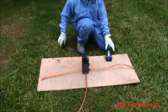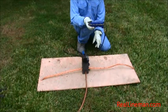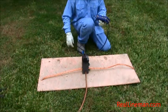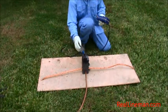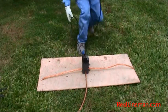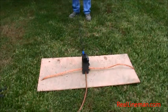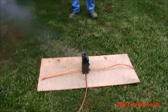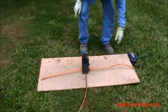When I get ready to shoot this off, I'll stand back the length of my cord, push the button to ignite it, and then jerk the cord off of the shot. The reason you jerk the cord off is that sparks fly out and will eventually melt through your cord if you leave it attached. So step back, hold the button down for a couple seconds — as you've seen, I pulled the cord off.